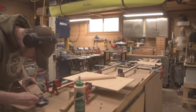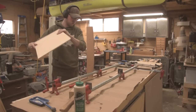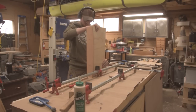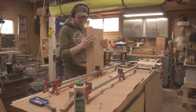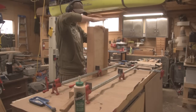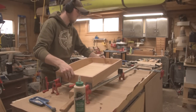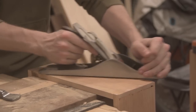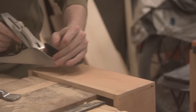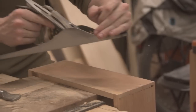But I'm also using 1/4-inch plywood here, which is going to be plenty strong enough, and these drawers are small enough where even if I'm holding my gold bar collection in there, I really should not have to worry about those drawer bottoms breaking. So is it a little bit of a compromise? Yes. Is it really that big of a deal? No. I'm not super concerned about those drawer bottoms getting broken, and if they ever do, it's just a matter of remaking a drawer, which is not exactly a thing that I'm afraid to do because, well, it doesn't take that much work, to be honest.